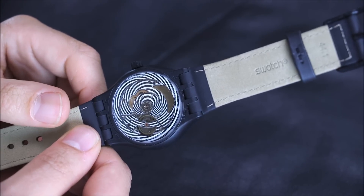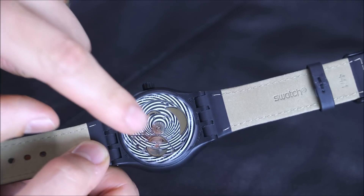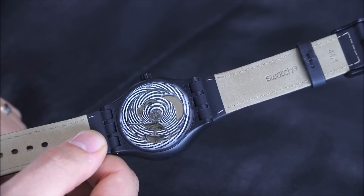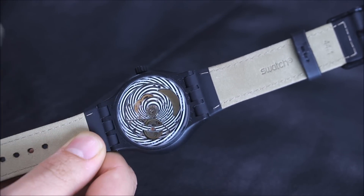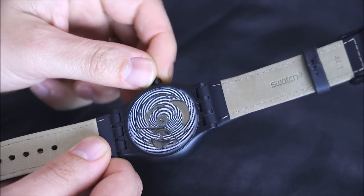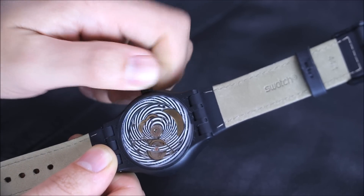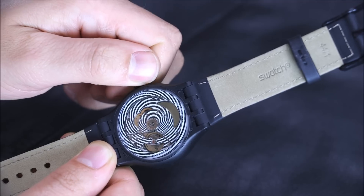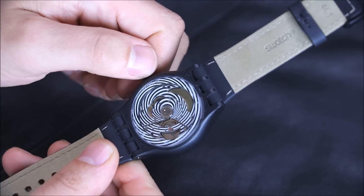The movement is called the System 51 because it's produced from 51 parts. There is one screw — you can see right there in the center — that screw is holding down the automatic rotor, and everything else has sort of little tension points to keep it together. You can see the balance wheel spinning there. It's a three hertz movement. There's a big barrel over here, and that large size barrel gives it a power reserve of I think 90 hours or something like that, which is quite a long time — several days. That's very impressive.